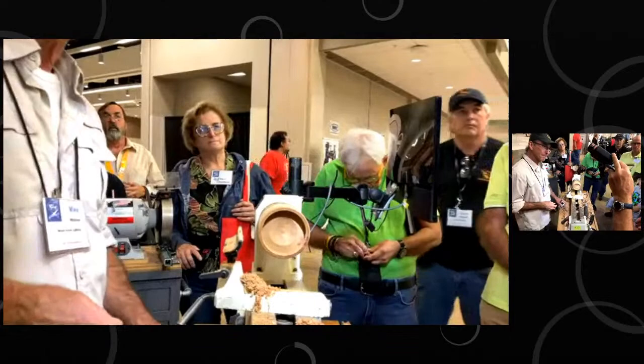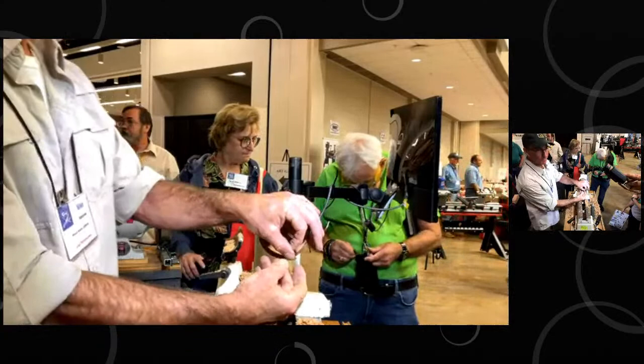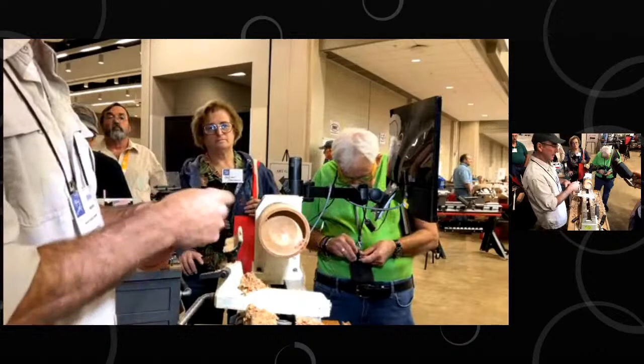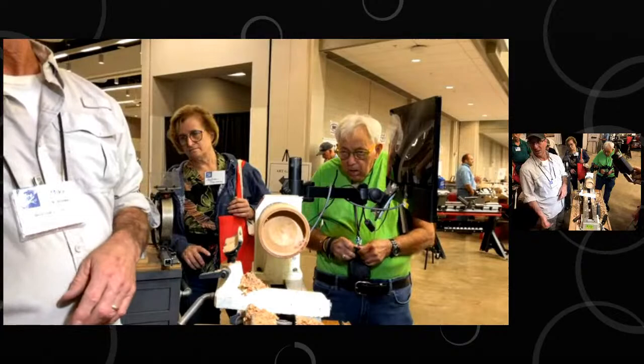Okay, you said 500 is good for this size. What do you mean by that? So when the work's really small, you can start decreasing the speed. As it gets bigger, you have to increase the speed because this point coming back to the same point takes longer. So you have to increase the speed. Did I get that backwards? What did I say? Increase or decrease? You said increase if it's larger with the diameter. Larger diameter, yes. Because the circumference is more. So you have to speed it up. Right. Okay. Sorry, I don't know what I said. But yeah. So that's how it's done.